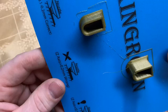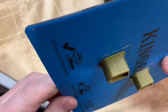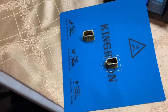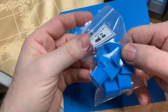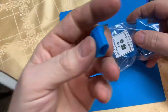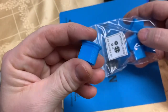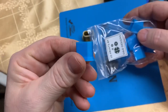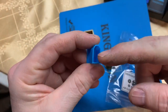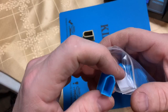There's a little bit of stringing, but that's something I've figured out. I did end up trying the newer version of Cura, the 4.5, and I'm able to print TPU with like zero stringing. This is the same part printed in TPU, and these are literally coming off the bed and I'm printing four at a time. There's no stringing between the four pieces. Before I switched to Cura 4.5 and tweaked some settings, I was having a lot of stringing. Every single one I've printed has been what I'd consider to be perfect, especially for TPU.